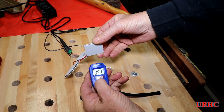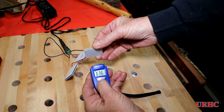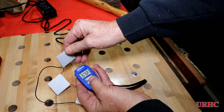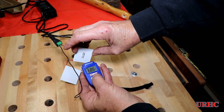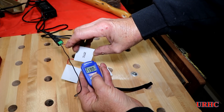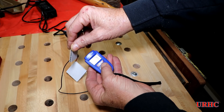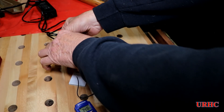And cool on the other side. That temperature differential reacts really fast, and it's just going to be a function of how big the heat sinks and fans you have on them are. Without heat sinks, both sides go up, but one side goes up a lot higher than the other. All it's doing is transferring heat — removing it from one side and exhausting it on the other. That just shows you how they work that way.